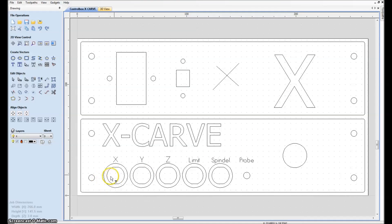Then I have the five holes here, which are for the connectors — it's pretty obvious what they are for. And then a bigger hole here, which is just for a 3.5 millimeter jack I'll be using for my probe. This is 22 millimeter for the e-stop. And then I have made a little decoration here — the X-Carve — which will only go half a millimeter in. And then I have engraved into the plate what the connectors are to be used for.